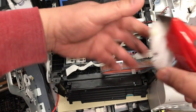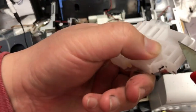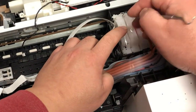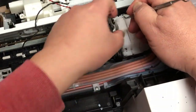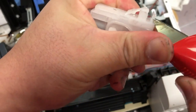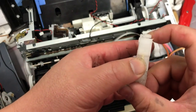If you have a half moon one and you want to fit it into the square slot, the only thing you need to do is look at your old damper, get a razor blade, and just cut through the plastic. It's really soft and takes about five seconds. If you want to take it out, you may find it's pretty hard because of that square plastic piece on top. You can use a dental tool to get behind it and pull the tab, or just cut the square plastic off. Instead of a razor blade, you can heat up a butter knife and use it to burn the square piece off. After that, it'll be pretty easy to put it in and remove it.